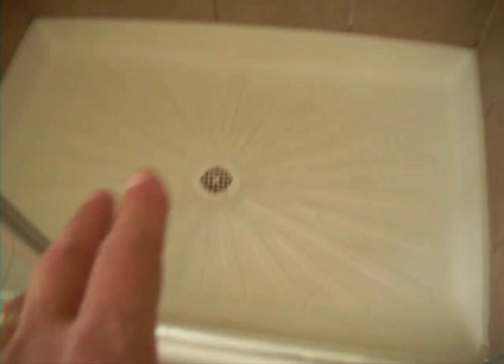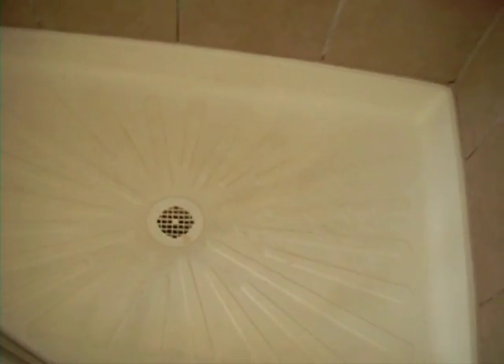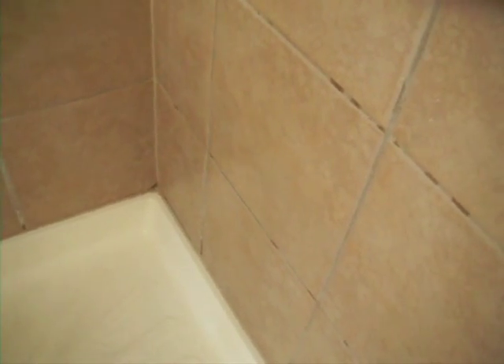I want to give you some advice about this type of shower pan. Beneath this is a drain, and that drain, when it's been left for a long period of time, can develop a leak once people start to use it again. At the present time there doesn't appear to be a leak at that drain, because what it does is show itself at the baseboards and carpet around the house. We haven't got any damage down there that's visible either by my eyes or the infrared camera on the day of the inspection. The reason it sometimes starts to leak is that it's not being used — it dries out, and then people put water in it and walk on it and it cracks the rubber. I recommend you run hot water through it for about half an hour with nobody standing on it before you use it. Also in this shower cubicle, I recommend that you re-grout the tiling — there are some cracks in the grouting.